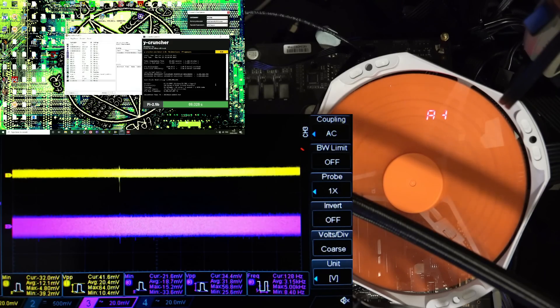I find that very interesting, and the same goes for LINPACK — LINPACK looks extremely similar to Y-Cruncher on the oscilloscope. In my experience I've never had to raise the memory voltage specifically for LINPACK, though maybe I should try that. Maybe sometimes when I'm having trouble stabilizing LINPACK, instead of messing with system agent or something, I should just raise the memory voltage — maybe that would actually work, and if it does, here's how I found out that's worth doing.